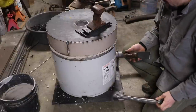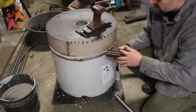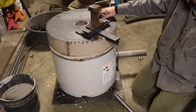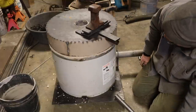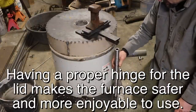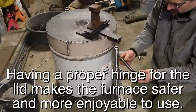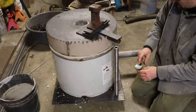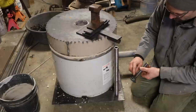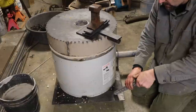I'm figuring out this hinge as I go. This is just a piece of inch-and-a-quarter heavy wall pipe that I've welded to a plate. I'll weld that to the top — I've got good solid material to weld to there. And then this is the same pipe, inch-and-a-quarter heavy wall, going to be welded on underneath. This is a piece of three-quarter inch solid — I took the cut-out of one of these brackets, cleaned it up, welded it onto the end, then welded a washer there so it goes down in there and spins well.